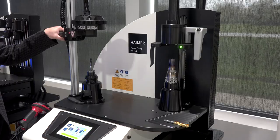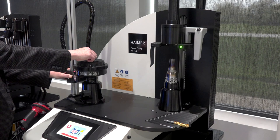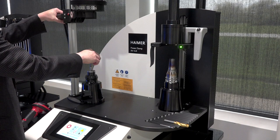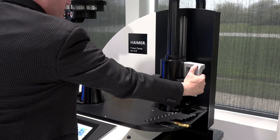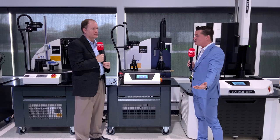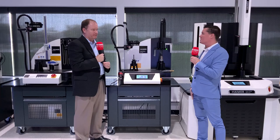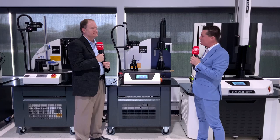When we're talking about ROI, from working in a job shop environment, one of the really great returns is if you have 50 or 100 tool holders — I've seen machines with 200 to 300 tools — and you have to finish a job, take all your tools out, and touch off all your tools again for the new job, you have a ton of downtime. That 30 seconds per tool versus two or three minutes per tool for a new job makes a huge difference. Utilizing something like this allows you to be prepared for the next job while the machine runs. Absolutely correct — we find the ROI to be extremely fast, sometimes three months as a max, maybe six months, depending on how many tools you're changing in a day. If it was 50 to 100 tools, it would be three months, no problem.